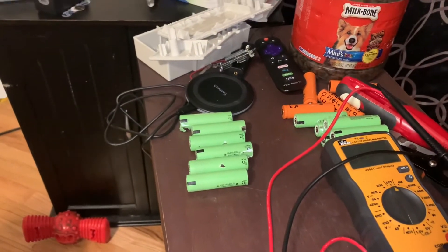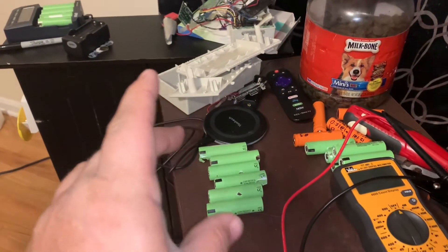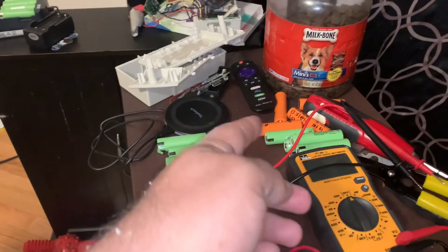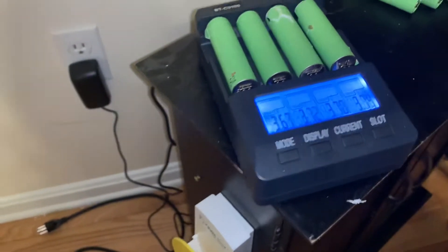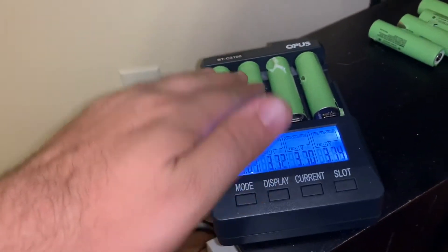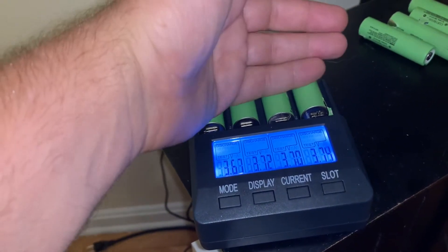I've been going through another battery pack and what I've got here is all the cells are above three volts, and these are between one and two volts over here. They've sat on here for quite a good number of hours. They're in their discharge process right now. I can feel them heating up because it is one amp. A couple more hours and these guys are still being tested.